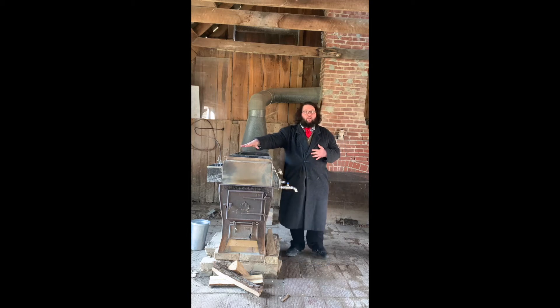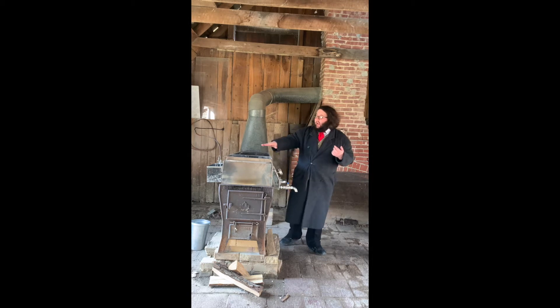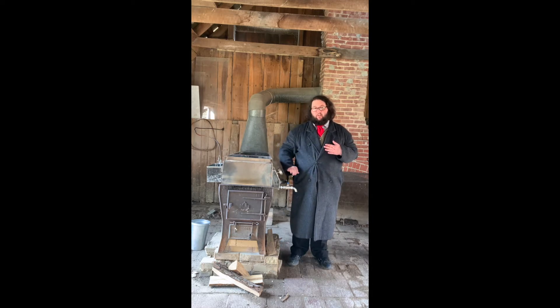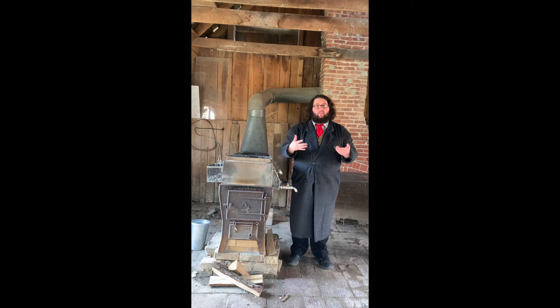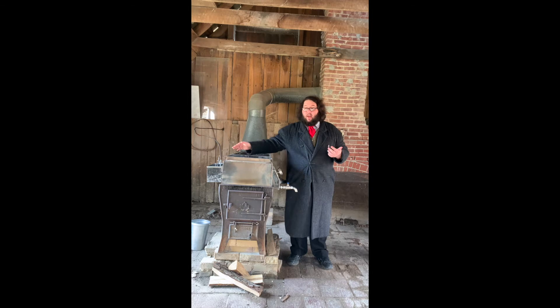At the front is where we get our liquid that is our thickest or most dense sugar liquid, and then we have sap boiling through the rest of the system. Once we hit that 66 percent sugar using a device called the hydrometer, we use this valve to filter out some of the byproducts of syrup, including something called sugar sand — the minerals that have crystallized in the boiling process.